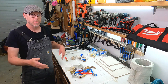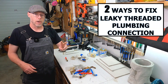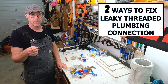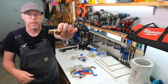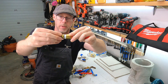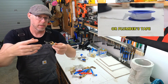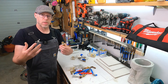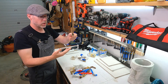Let's talk about threaded plumbing connections, or specifically leaking ones. Two ways to fix that problem, and one way you should probably not use to fix that problem. Here we have a plumbing connection — a female thread with a male thread going into it. It's got some thread sealant around it right now, some plumber's tape or Teflon tape, also called PTFE. It's on there and it's leaking right now.